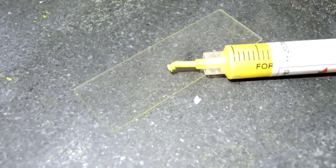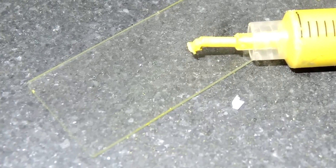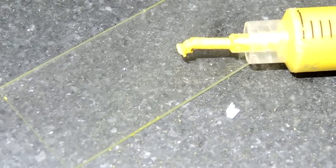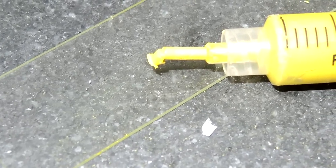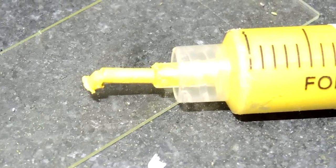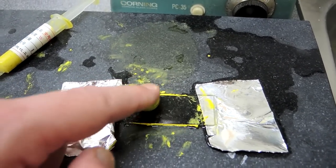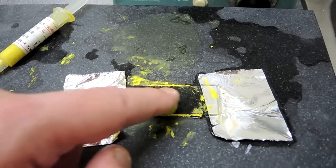So I went over to my flat surface plate and took a glass slide from a microscope kit — glass can be very flat. That yellow substance is a diamond polishing compound I use to keep my chisels for woodworking nice and sharp. Very, very gently with very modest amounts of pressure, it was removing an incredibly small amount of material. Flipping it over, here's the micro photograph — it looks like I chewed through basically all the layers at a slightly different rate. So it's kind of a first success: I can now count the number of layers in the silicon die.